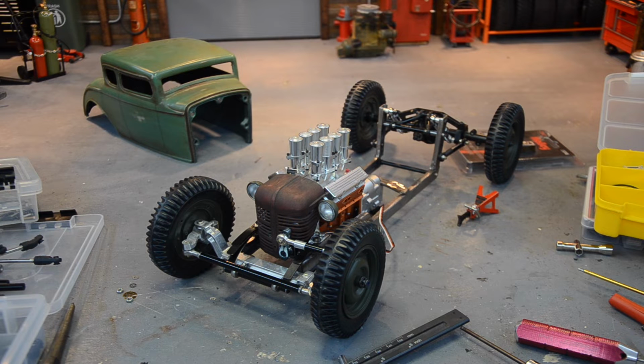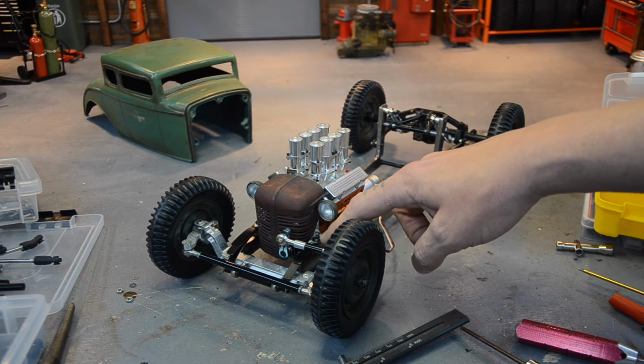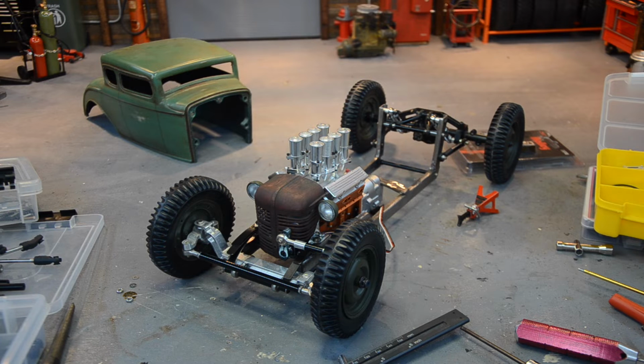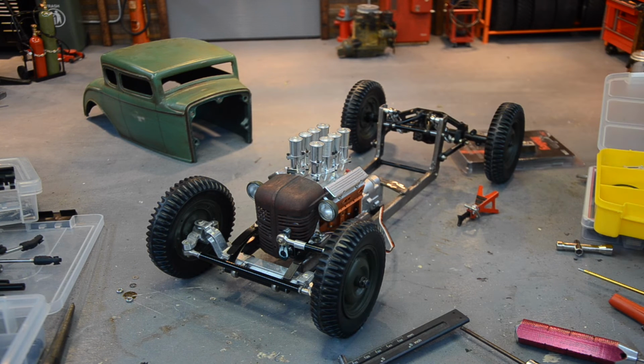And those other screws we talked about, I don't even know. Those are like M3.5 or M4 or something that I ended up mounting the leaf springs with because I screwed it up the first time, so we went with a larger size, drilled it out, tapped them. I finally shaved down those screws, as you saw, because if they don't make something we need, we make it ourselves. That's all we can do. And it worked pretty well.